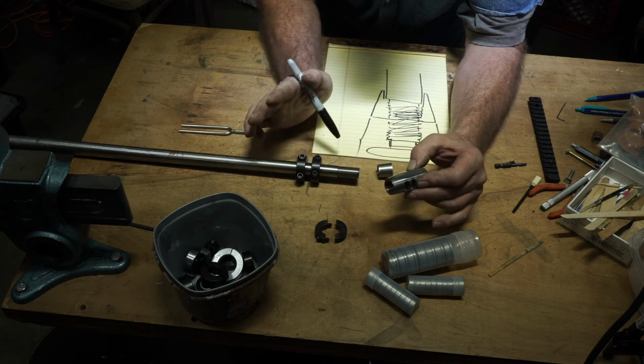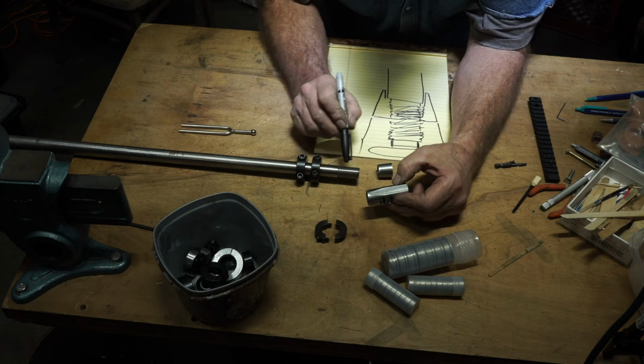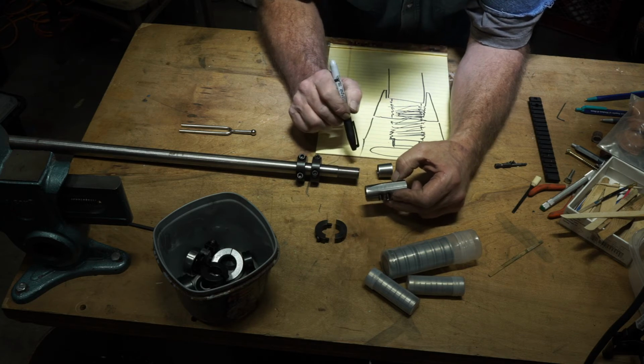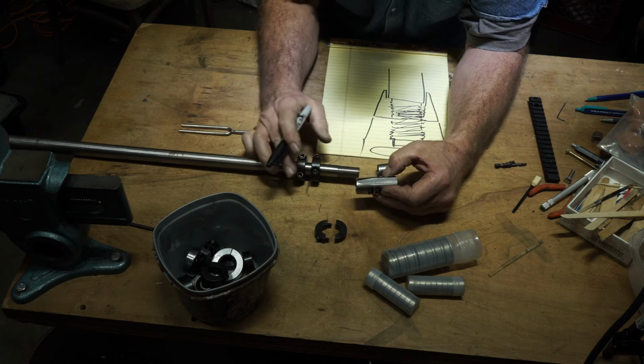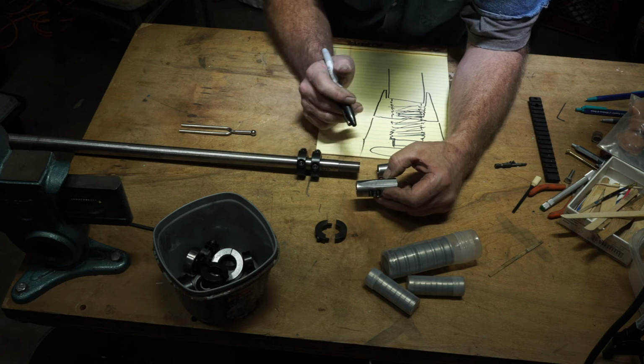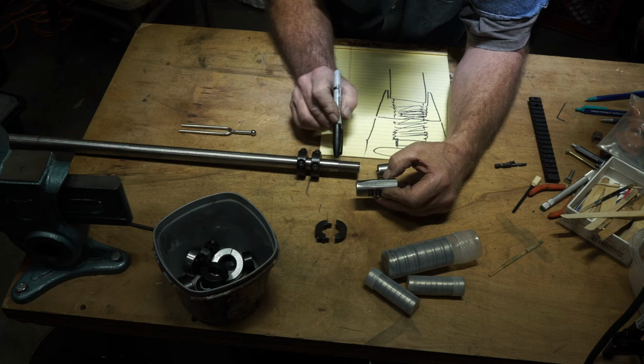And here's where the problems come. This is what we're doing. We're trying to eliminate problems. I've got this particular barrel threaded at what I consider to be the minimum diameter that I would want to go on here, because this happens to be, I won't name it, but it's a button rifle barrel, and there's a contention, true or not, I pin these, and I've never actually found a change from here to here, but I don't do big steps.